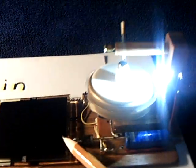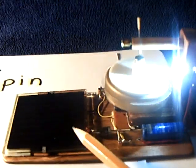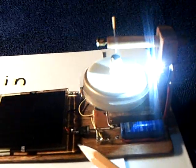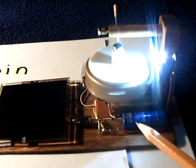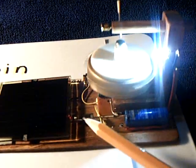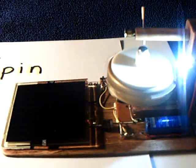This is what I'm calling the forever spin. I'm Lid Motor and it's the 28th of January 2013. This is going to be a situation where I'm going to have to feed it like a pet — basically with enough energy to keep this filled up enough to run through the night. You have to position this somewhere in your house close enough to a sunny window that it gets enough during the day to run through the night and is still running in the morning. I've tested this without the LED and it can make it quite easily through the night on a filled-up 10-farad cap.